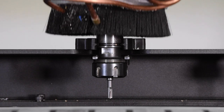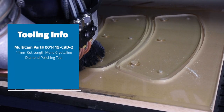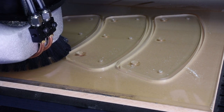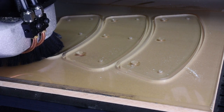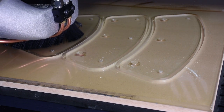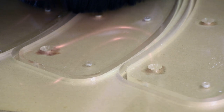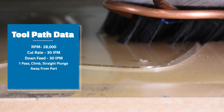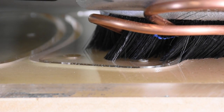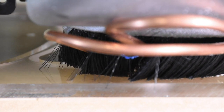The machine is picking up a diamond tool right now. Is that a mono or a polycrystalline diamond tool? For this application we're using a monocrystalline diamond tool. But I thought a polycrystalline was like two to three times cheaper than a mono — why would you choose to use the monocrystalline? The mono will give you a much clearer edge finish as opposed to the poly. The poly will give you a good edge finish, but it won't be as clear as the mono. As a matter of fact, the mono tool I've been using for the last three and a half years, which I've taken to many shows and done many projects with, still gives me the same beautiful edge quality.